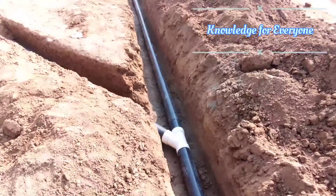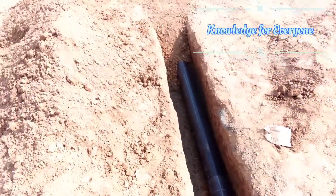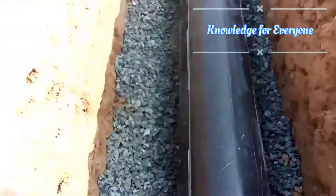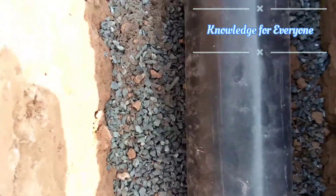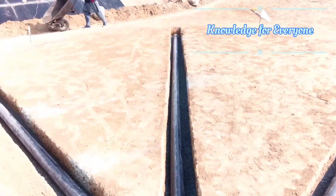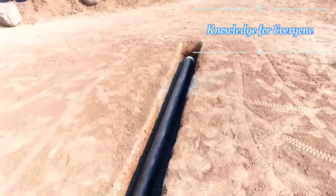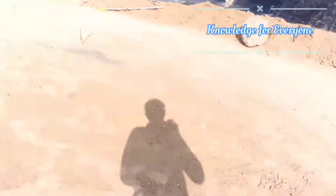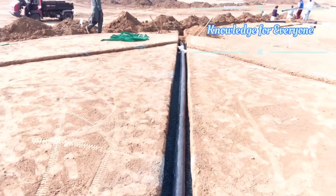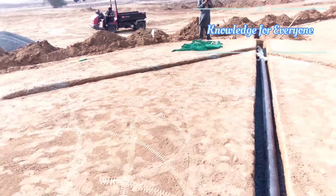Here is the main line, then I have a Y-T connection for my third tee. The solid blind pipe goes up, the filter pipe starts, and we have two laterals — left and right — and one central line. This pattern of drainage is called herringbone drainage; it acts like the bone structure of a fish.